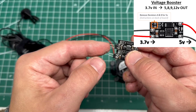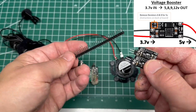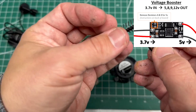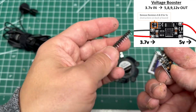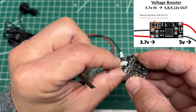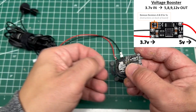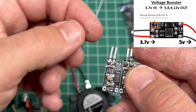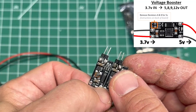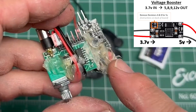Additionally, I used a straight set of header pins and soldered them on like this. You could do it either way — you could do it like this which is probably better, but I was trying to keep the bottom flat so it could mount flat with straight pins. Your choice, or you don't have to do that at all. This is your power in, nicely labeled with an arrow in. So I've got my 3.7 volts coming in and 5 volts going out with a positive and a negative. I wired those accordingly, which you can see through my amalgamation of hot glue.